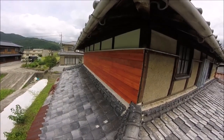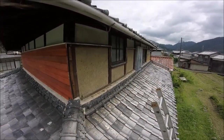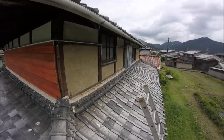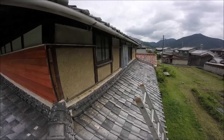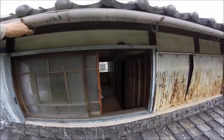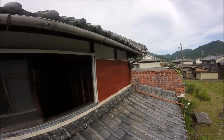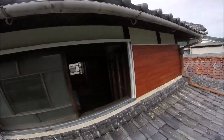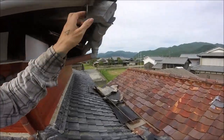That section's done. I've already moved around to the next section and stripped it, so it'll be the same again — battens in at 600 centres, get it all painted up, and then put the rest of the cladding on. It's just going to be the same the whole way around. I did say I'd do before and after pictures but I got a bit carried away and forgot to do some.